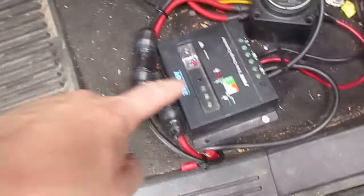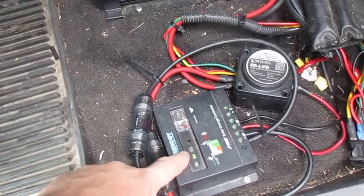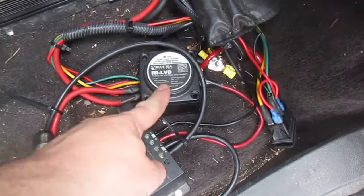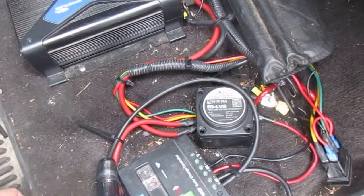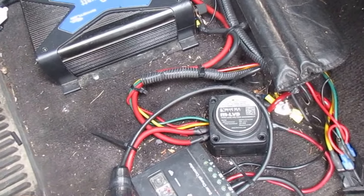You can see the battery's floating. This icon shows that the battery's floating, so it's limiting the voltage going to the battery. The solar panel's running. This unit here disconnects all the load if the battery drops below 12.1 volts to keep the battery from over-discharging and getting damaged.